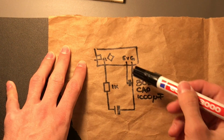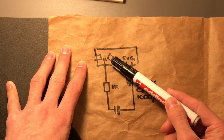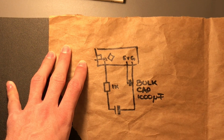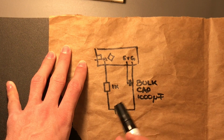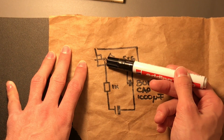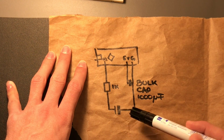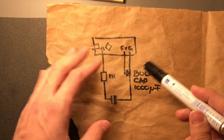Actually, I should tell you now, right? So the principle of operation is in bursts of 10 milliseconds. And again, all the values have been chosen due to expert judgment. I mean, any value should work, right? But 10 milliseconds I find to be a reasonable amount of time to charge this at. So we're going to drive the analog pin high for as long as it takes this to get to 90% of the bus voltage.